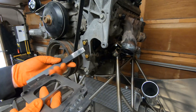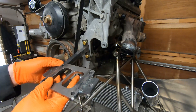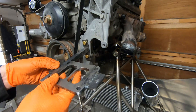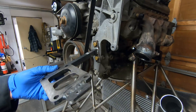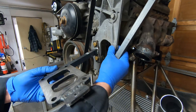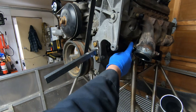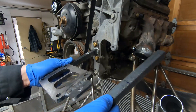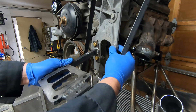The way I'm going to mount that is with a piece of angle iron. That angle is intentional — the canter might be a bit much but I'll try about there. The flange will be out here. I'm probably going to do a second piece and connect it in there; there's also another bolt I could connect to if needed. But honestly this seems pretty sturdy already, so I'll bring this in, bend it, and tie it into that bolt there.